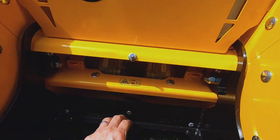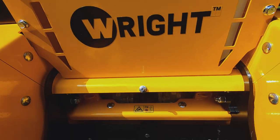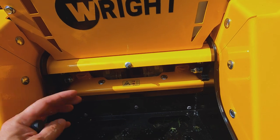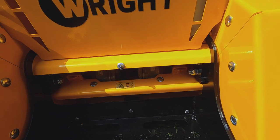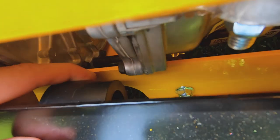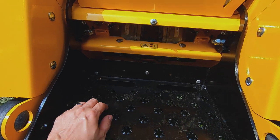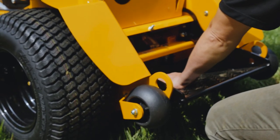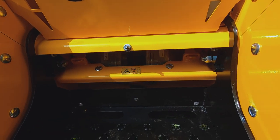Our platform is a suspension platform with a pretty good amount of movement. There are holes here so leaves and stuff don't collect and they fall through. Up behind here there's a switch — you have to be on the platform in order to turn the blades on, like many of our machines. One method is a safety on the hands where your hand has to be there, but those tend to be problematic — they sputter on and off. This one's in the platform. Right in front here, there are three elastomer springs. You can certainly run with all three, but there are options — you can move the spring up closer to the axis to soften it a little bit, or you can remove the middle one if you want a softer ride.